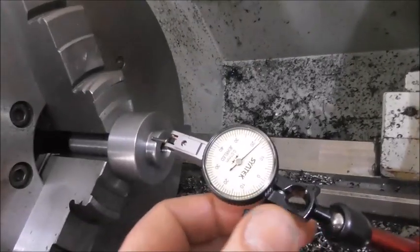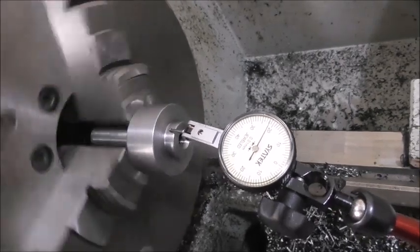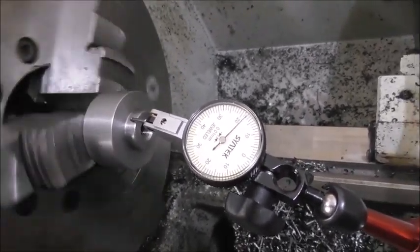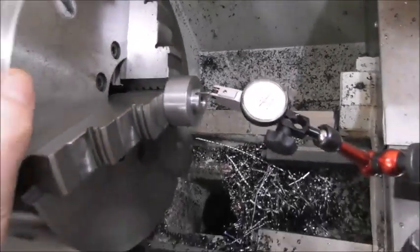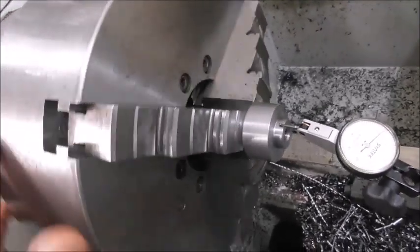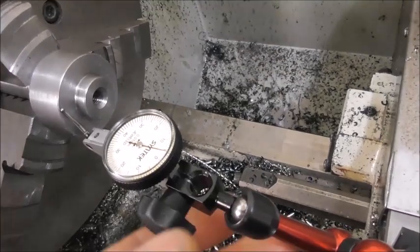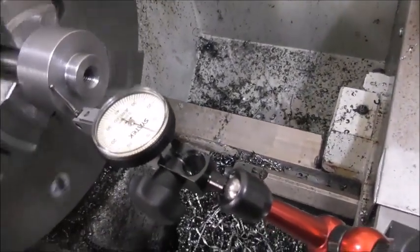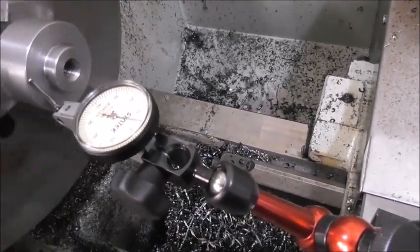Here's the arbor — it's quite accurate and running concentric relative to the shank. You can dial it in with these adjustable chucks — I've been raving on about these. And equally important, it needs to be concentric on the face as well. It's just a rough surface finish but it's running pretty true.